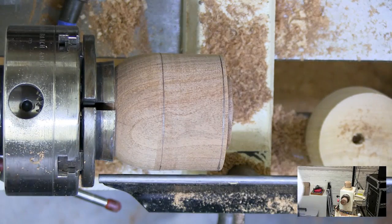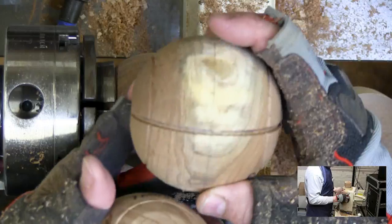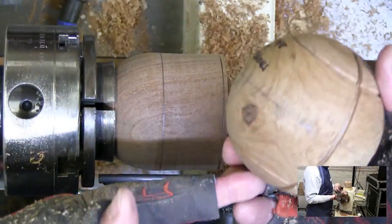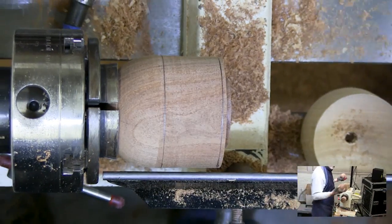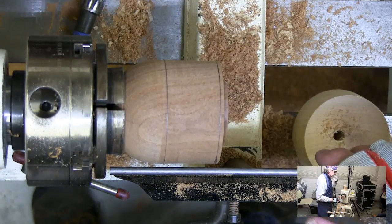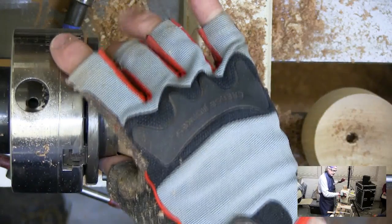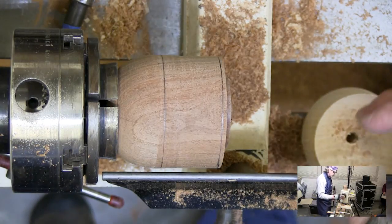The key with this is that you've got to be able to cut this tenon such that when you then reverse turn the piece 90 degrees and cut that groove in it, the groove has to cut through that tenon so that when you shape it to the true sphere, the tenon goes away. So this is an example of the tenons on there, and then the groove has been cut on those pieces. That's all that holds us together, but it gives you enough of a grip that I can do all the things that you saw on those pieces.